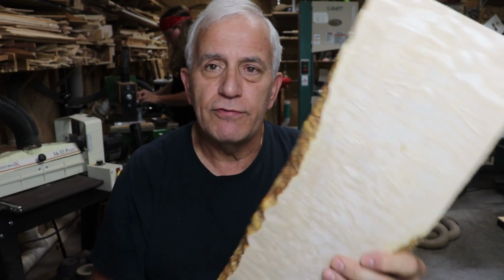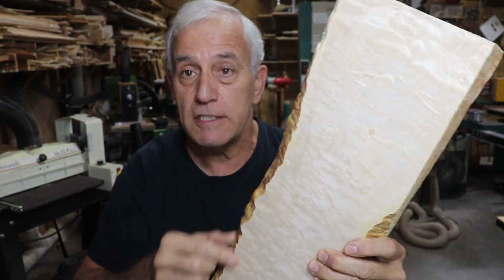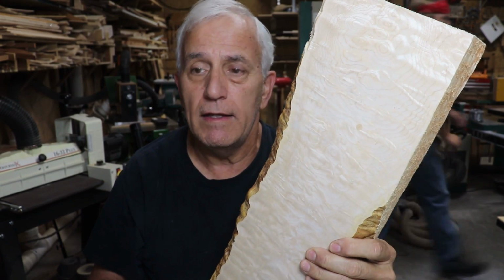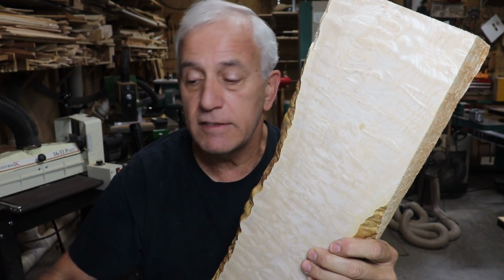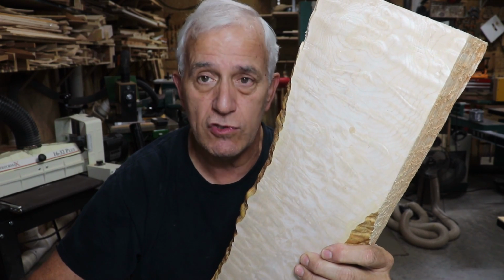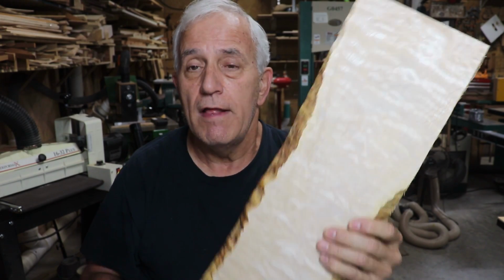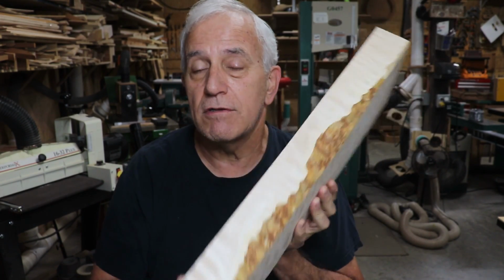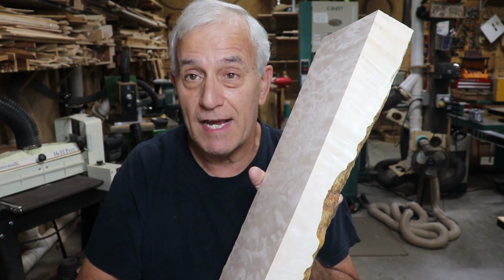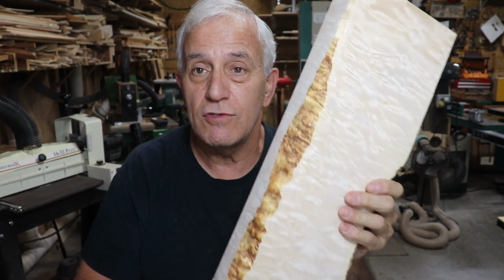So what I've done first is, because this is such a thick block, I'm going to have to slice pieces out of it. I have determined that the size of the slice I want to make is exactly 600 thousandths of an inch. So I'm going to slice two pieces out of this at 600 thousandths of an inch. That should leave us with plenty of material left to make the sides out of, and possibly even the neck. So I think we'll be in good shape.